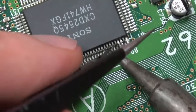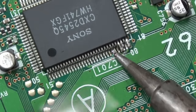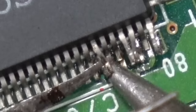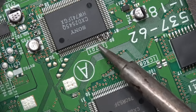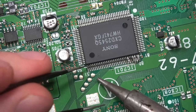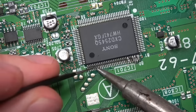I'm basically following the installation diagram from the X Station. You get it from Castlemania Games — it's $100, I'll put all the info in the description. I'm going through and lifting the pins off the board. Those two points are very important: the lifted pins can't be touching and you can't have any bridges.